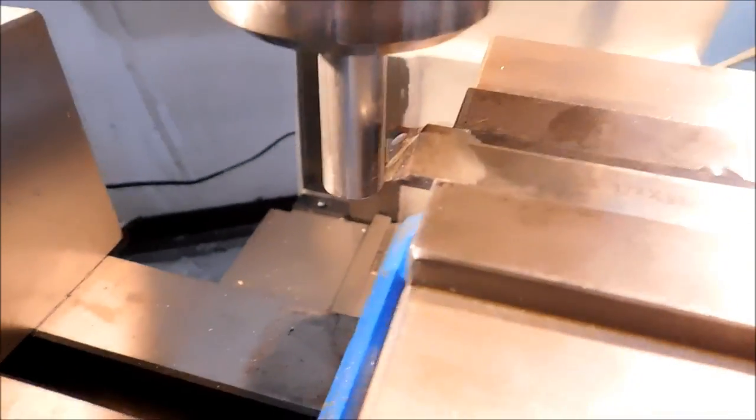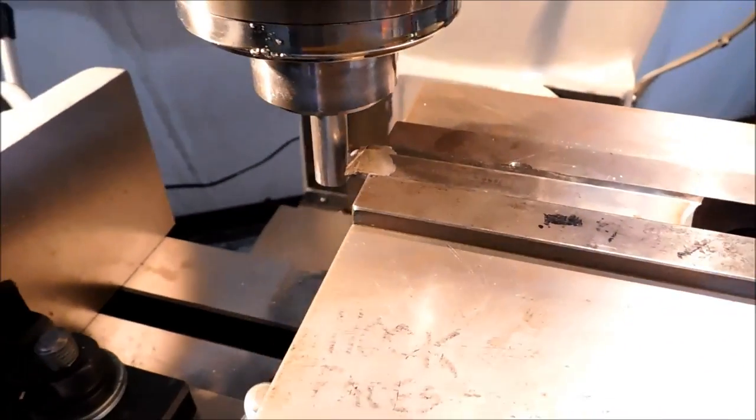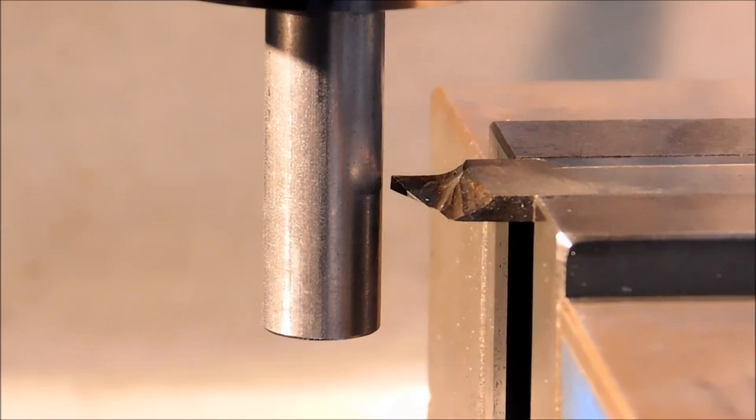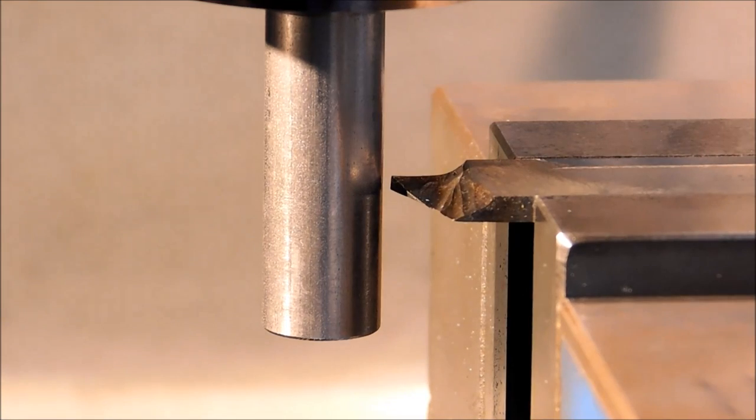We're going to cut that off here. Could cut it off in a bandsaw or however, but anybody that's never seen this done, there you go. Now you've seen it done. Or you'll see it done here in a second. Hang on. We're going to try this at 660 RPM, hand feed. And I'm cutting off approximately 600 worth of the end, okay? 600.